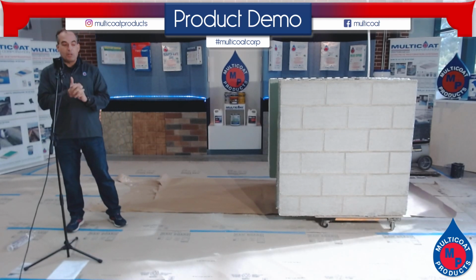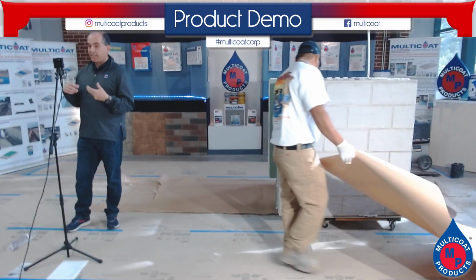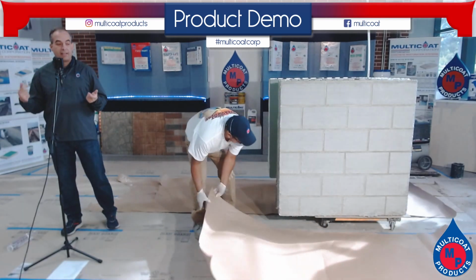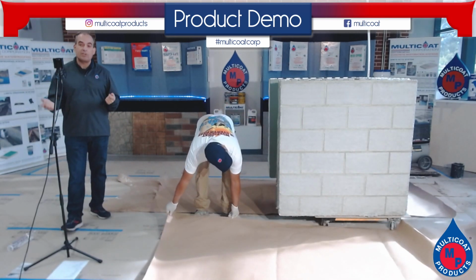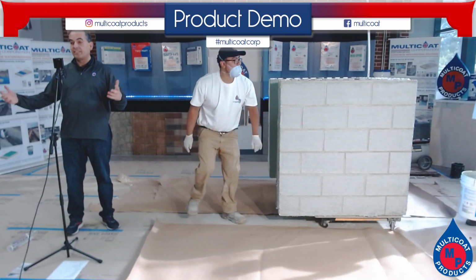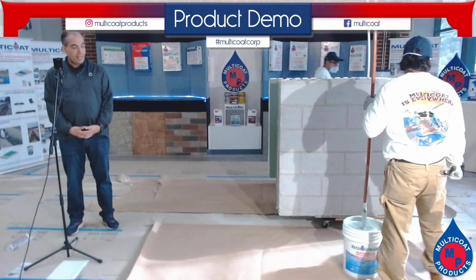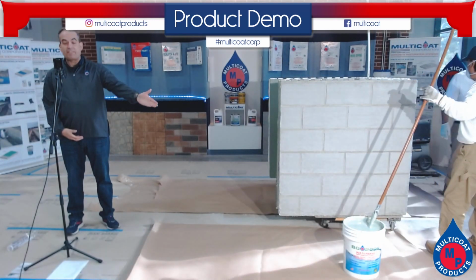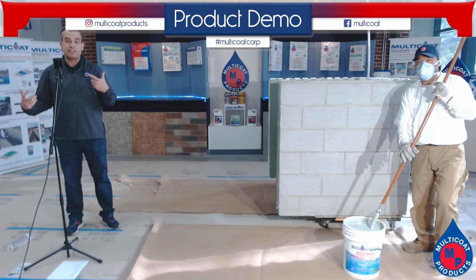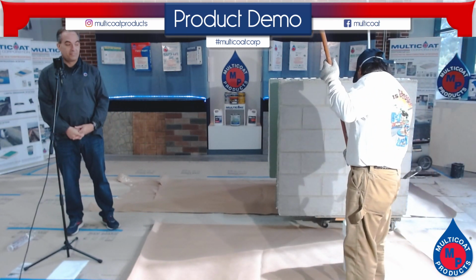So the beauty of our BG is it's got no odor. Guys that are working with it can clean their hands with soap and water. It is a green product, less than 5 VOC, as compared to a lot of our competitors. They're like 170 something VOC. It will give you 200 square feet per 5-gallon pail. A lot of our competitors, at best, you're getting like 125 square feet.